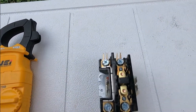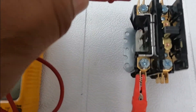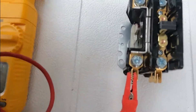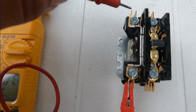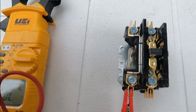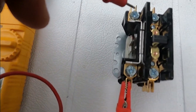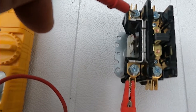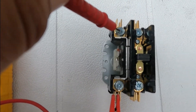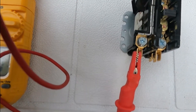Now let's talk about continuity. This is my single pole, and remember we said that this one is always on. So let's do a continuity test — it should be on at all times. When I put my lead and touch this side, we should hear the sound of continuity. That's always on because there's no restriction here — there's no plunger.